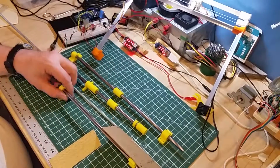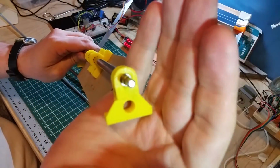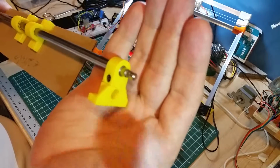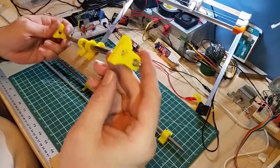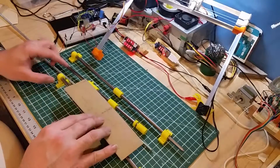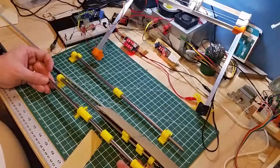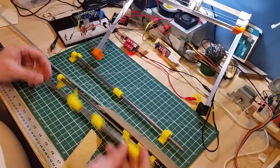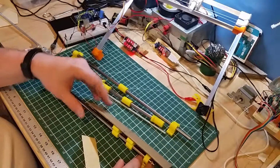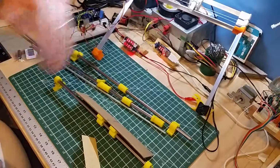As you can see, I was 3D printing my parts. I made this part here. I don't know if that's going to show up. I think it's going to show up. I made this part here, and I'm going to put that up on Thingiverse. Hopefully that's showing. And that is eventually going to hold down on the main frame or the main bed down below. And it will allow that to move. And this rail is, we'll call it, the sister rail to that one. And of course, this is only the same as the print bed in one direction. I cut it short just for working with. And this will probably end up being the Y with the X over it like that.